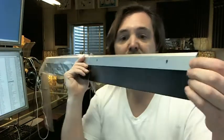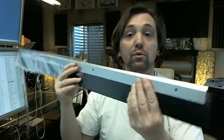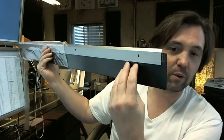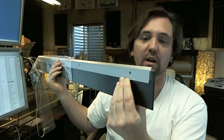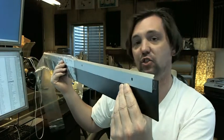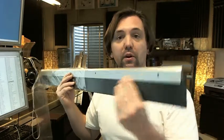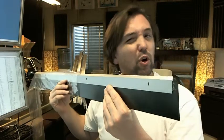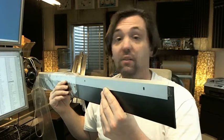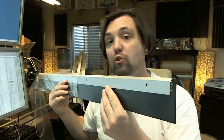Available in different colors on the website. A door sweep like this is not commonly used in new construction because something with 2 and 3/4 inches worth of exposed seal is not a typical application regarding an undercut of a door. A sweep like this is used more commonly as an item to correct or remedy a certain situation, like if you have an excessive undercut under the door or an unusual floor condition at the bottom of a frame.